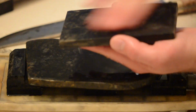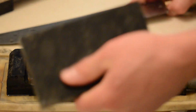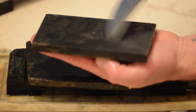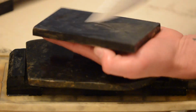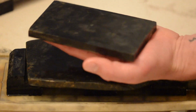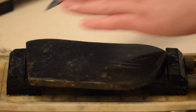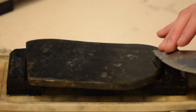So if I take a smaller piece like this one, this is not as polished yet. It still could use more smoothing in. It's at about maybe 300 grit instead of 600. You'll hear the difference. It's louder. It's taking more metal, because the pores of the stone are a little more open. And so when you use a stone that's harder than steel, every bit of motion, you have abrasion. You have the stone rubbing away the steel because the stone's tougher.